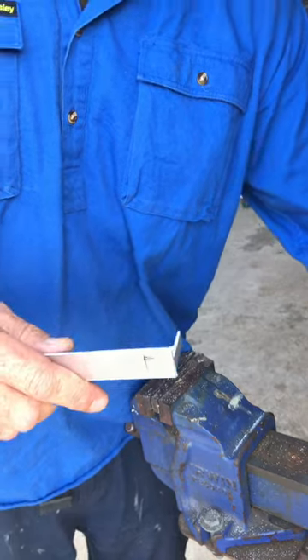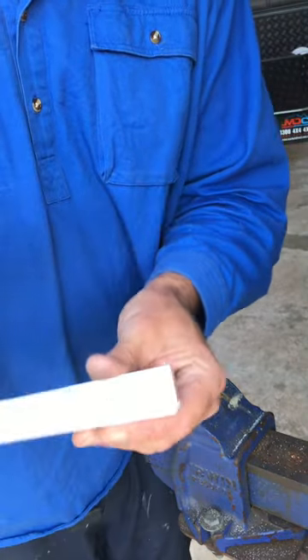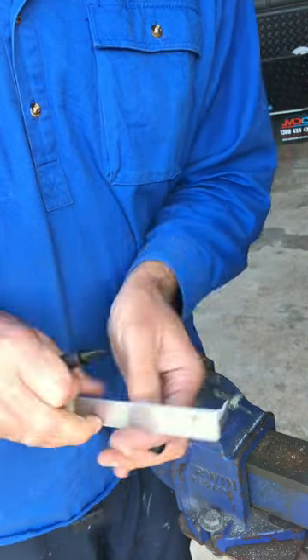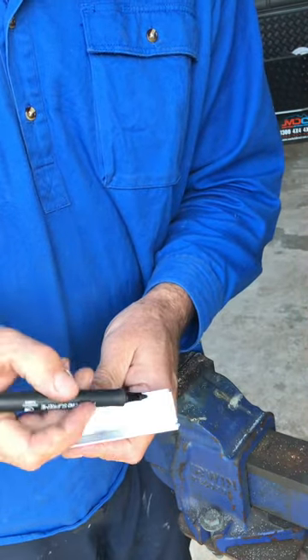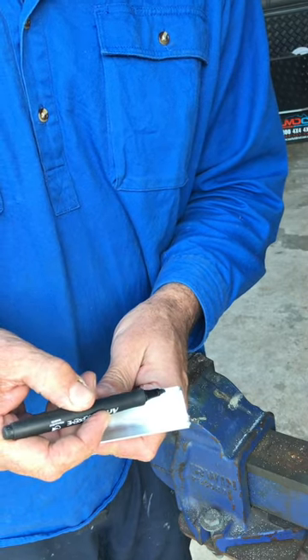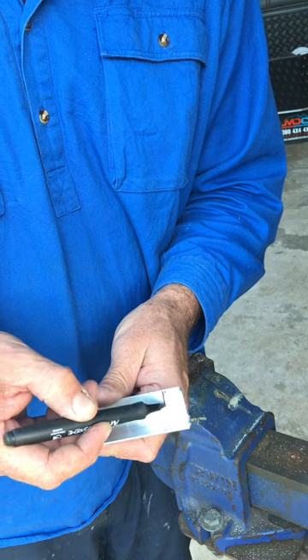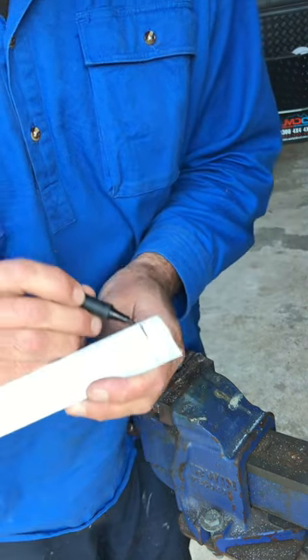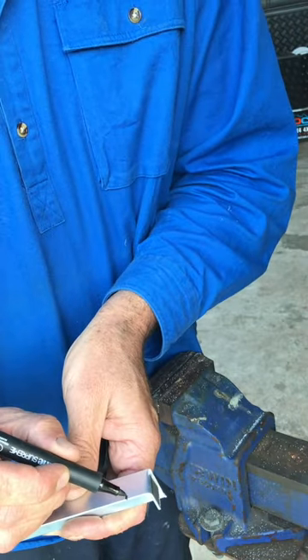The crucial measurement is — you've got to measure. Usually you just hold this up against the awning and you measure where that channel is, how big that gap is, where they normally put silicone, where it's missing. And it's good to put a line through — say it's about that much. You transfer that line to the underneath, just go through and transfer it to the underneath.